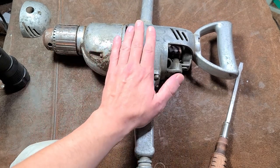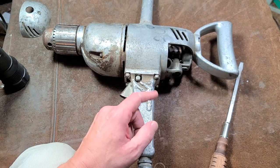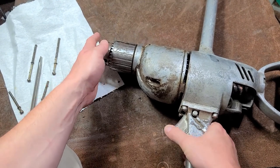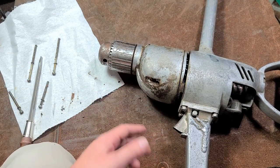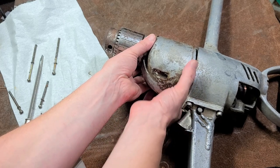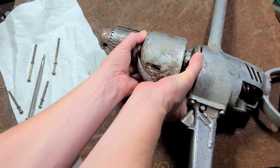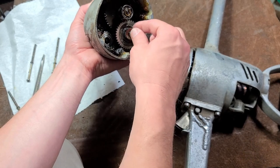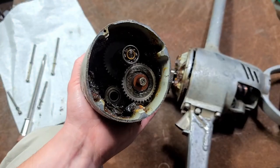The case is dented here and dented there, so the field can't even be removed anymore because of the way it's dented in. I got the screws out — surprisingly, these upper screws only had about that much thread catching into it, they're still tight, but definitely a bit short. This thing is practically falling apart just by pulling out the screws. When you try to pull these gearboxes apart, I recommend you hold the diaphragm and pull the gearbox out itself — and there we go. We have a thrust washer which I assume goes right here.